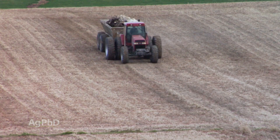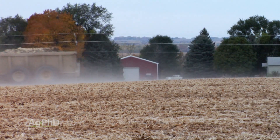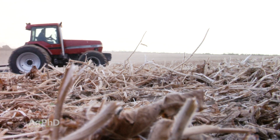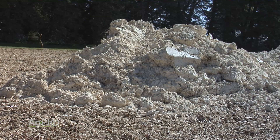Whether it's to loosen up a tight, high-magnesium clay soil or to balance out fertility levels in general, calcium — and especially lime — is in high demand. Unfortunately, you need a lime spreader to get the job done unless you're going to use pelletized lime. The chain and paddle drive on a regular spinner spreader just can't move a bulk ag lime product.